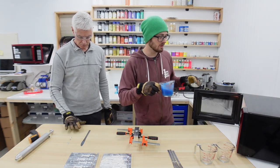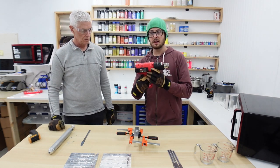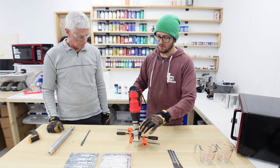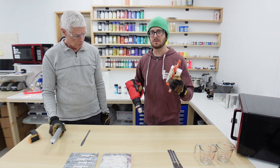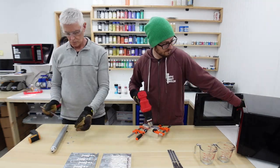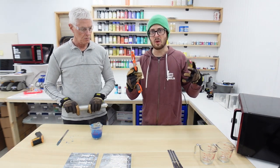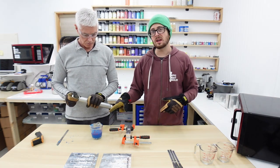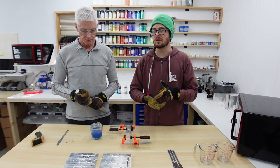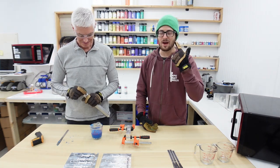After mixing the color, the temperature dropped down to about 290–300 degrees, so we're bringing it back up to temperature. The mold and injector are cold, so we grab the heat gun on full blast and heat the mold for about 30 seconds to take that cold edge off. This matters more in winter when the mold is around 50 degrees — in summer it's not as critical since molds will be 80–90 degrees. We're targeting about 350 degrees. Always lightly stir while taking temperature — stopping causes the surface to cool 5–10 degrees.